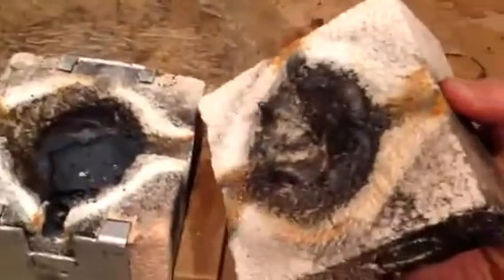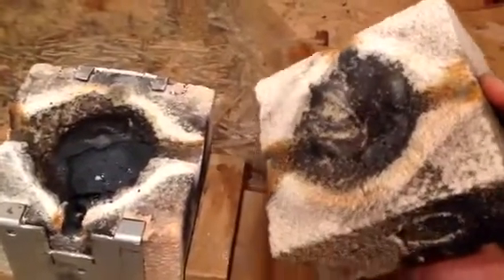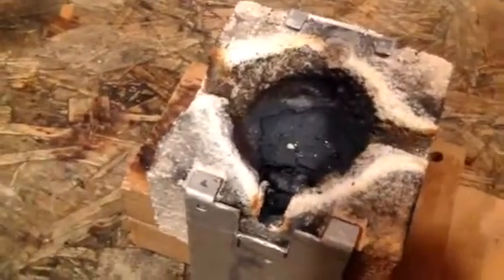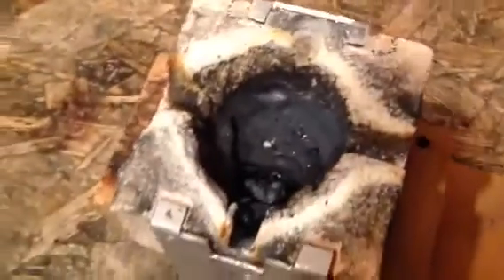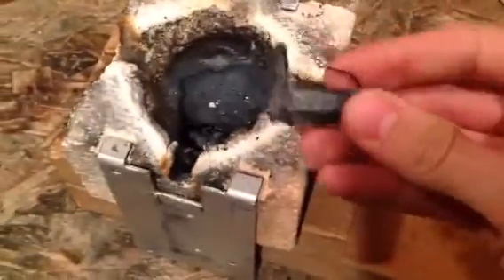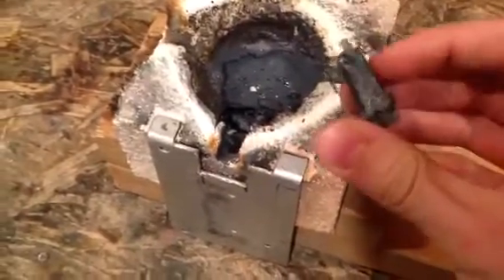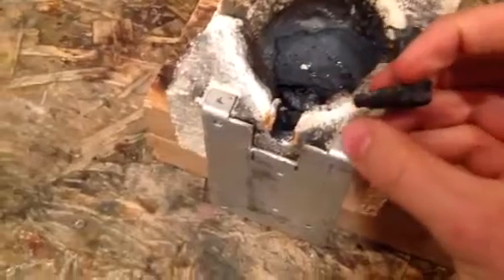The underside has become very melted. This happened when I melted iron for the second time, this time more successfully. Inside the furnace there is some black, kind of melted firebrick from the iron pour. This iron pour went much better. This was the result of the first iron pour — this is the sprue right here, and this right there was the gate.